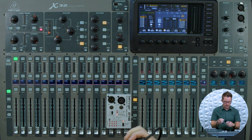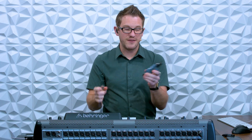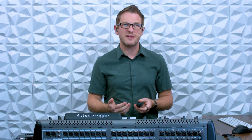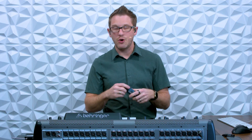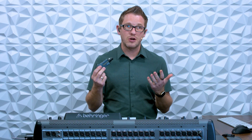To check this, all I would have to do is turn it on, and then I have a negative 10, a negative 40, and a negative 20 adjustment as far as gain goes. If I wanted to check an output, all I have to do is plug in this side into the output and turn up the little speaker. There is also a headphone jack if you wanted to use headphones, and you can listen to the outputs to make sure those are working. Both the Sound Bullet and the CT100 have cable tester modes that can easily check and make sure that things are wired correctly — making sure that pin 1 is going to pin 1, pin 2 is going to pin 2, and pin 3 is going to pin 3.